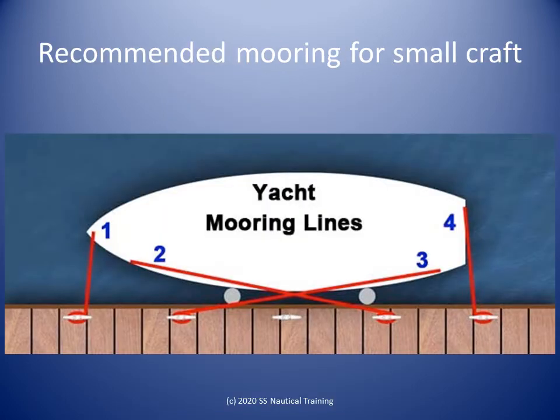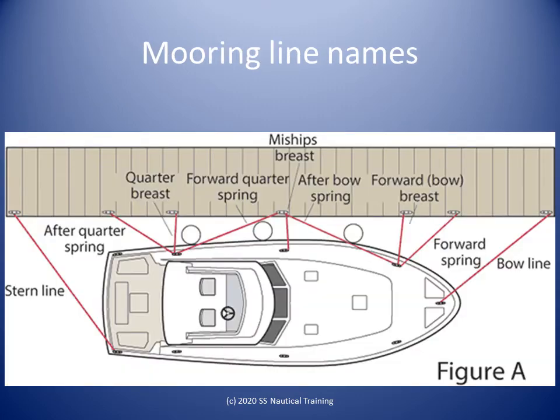The recognized and safe method for securing boats alongside a quay in a good seamanlike manner is by using ropes that restrict lateral movement of the boat off the berth and ropes that restrict forward and backward movement on the berth. In this diagram, lines 1 and 4 are holding the boat alongside, while lines 2 and 3 are restricting forward and aft movement. Breast ropes restrict lateral movement of the boat off the berth and spring ropes restrict forward and backward movement on the berth.